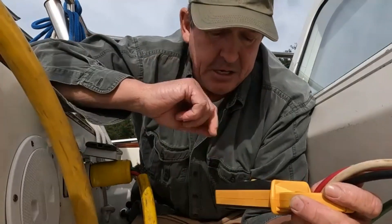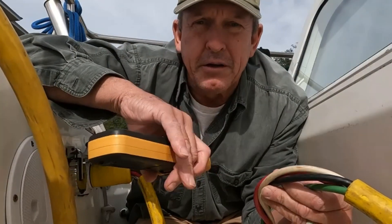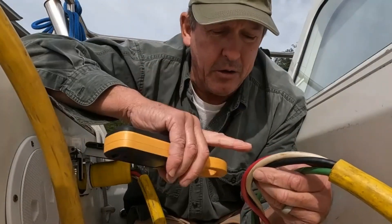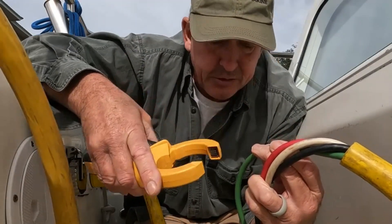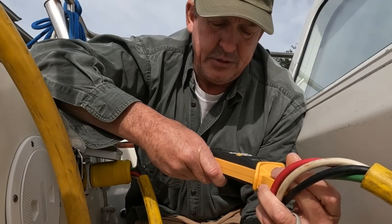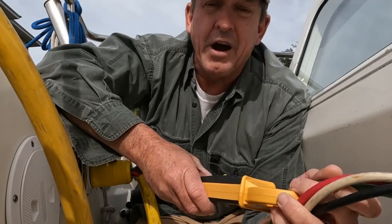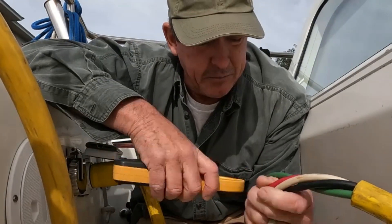That's considerably greater than the five-milliamp threshold of the ground fault breaker. That almost quarter of an amp is going somewhere other than the shore cord — it's finding a path back to source by means other than the current carriers. Let's check the ground conductor — and we can see right there that 0.105 of an amp — 106 milliamps — is being conducted away on the ground. That's significant and would also trigger the breaker.